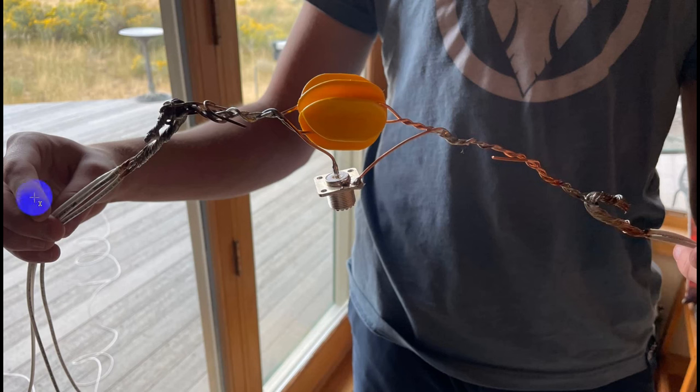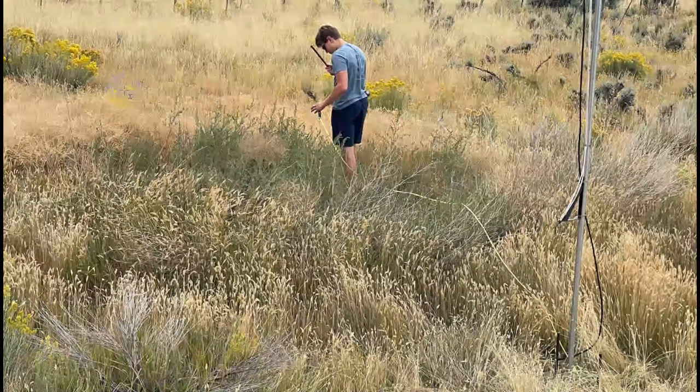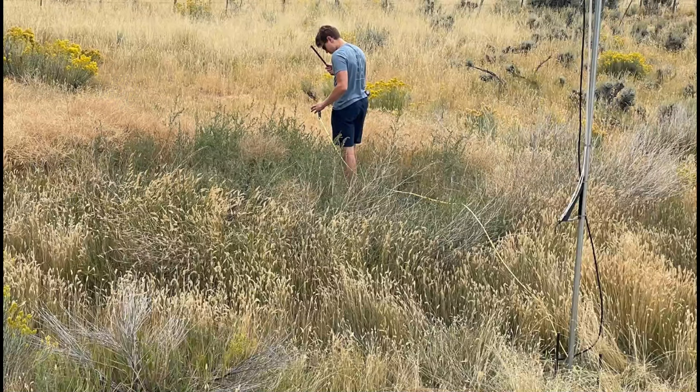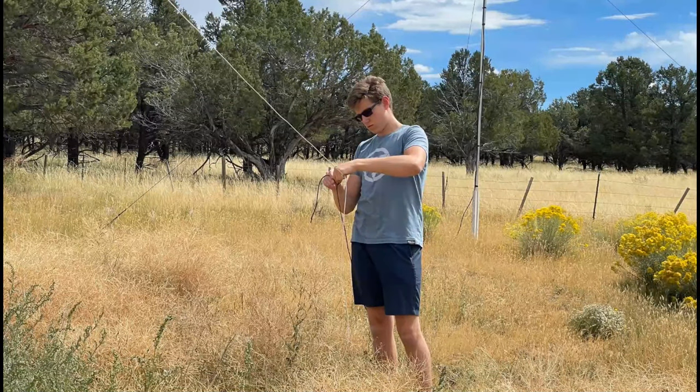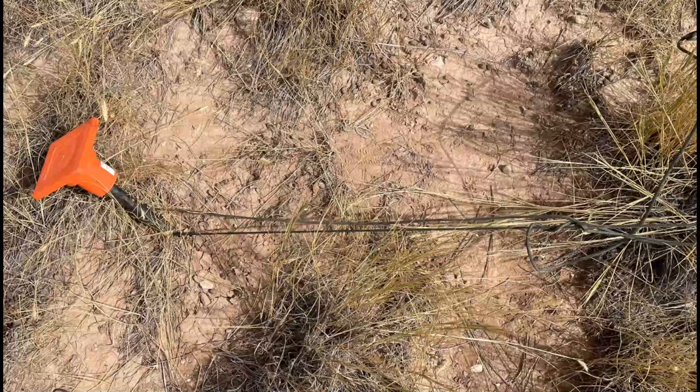So this is what he's going to take out — he's got the three wires on each end. He's out there measuring a distance from our new 30-foot test mast. We're trying for 120 degrees at the center; it ended up sloping about 90 degrees, but it works. Here he is tying the end of the 40-meter element to the rope that we're going to use, and that rope was attached around the stake. Notice I put a little safety slab on top of this two-foot stake, and the rope wraps several times around the stake and comes out here for a simple knot.